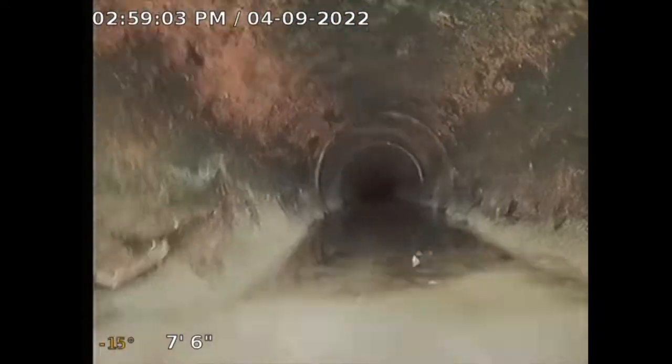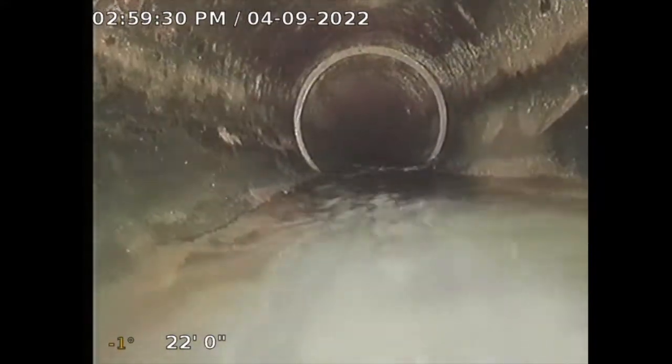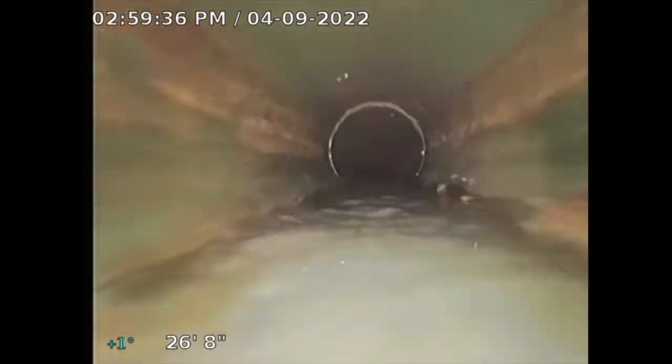We're going through a clean-out located in the lower bathroom. The main sewer line is ABS sewer pipe. I do see a little pool in the water, maybe a little slope. I have the bathroom upstairs bathtub running, so I'm going to use that — it helps me push. Right now the main sewer line is 4-inch ABS pipe. It looks okay, I don't see any issues. The property faces south, so that's the direction of this sewer line.